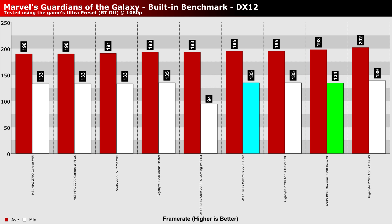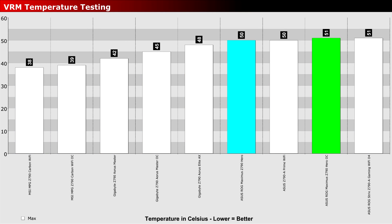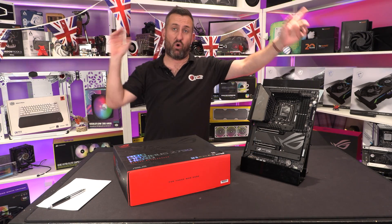So the Hero — performance in the graphs was pretty good, and overclocks were solid too. We did consistently have CPU temperature issues that were different from the other boards; I struggled the most to keep this one cool, even running air conditioning with all fans on to find stability. That's part of pushing to the upper limit, but at home it'll really depend on your cooling. With an i9 you'll need custom cooling; with an AIO you may need to taper things back. If you're leaving your CPU at stock, do yourself a favour and undervolt it.